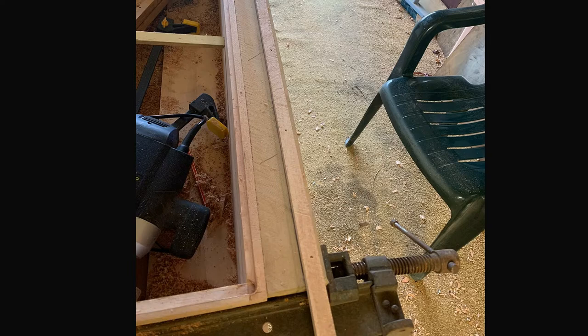Now, he also doesn't have a rebate cutter with a bearing. He's only got a straight cutter. So what he's got here is he's set up a support in line with the back of the box, and that packer is the width of the distance from the edge of the sole plate on his router to the edge of the cutter. On the right hand side where the clamp's pushing onto it a bit, you can see, I think he might have nailed it on, there's a guide. He's nailed a guide on